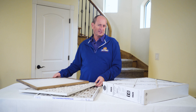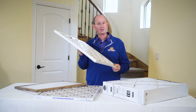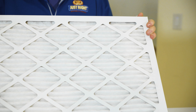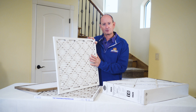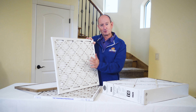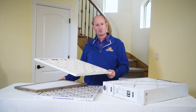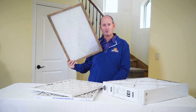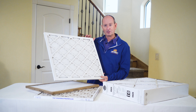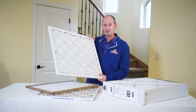Some of the problems I've seen over the years as a technician is a customer will put in a pleated filter because they want to clean the air — that's the goal of this type of filter. This is a high efficiency air filter to catch allergens, but it also restricts the airflow. Somewhere you have to choose between good airflow and not-so-good air filtration, or a pleated air filter that catches a lot of dirt but restricts the airflow.